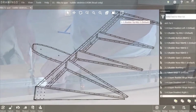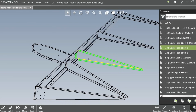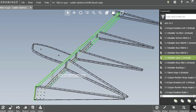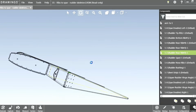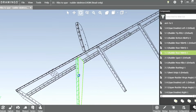Now, just a couple of questions. You say skeleton, so that's the internal section of the airplane, is that correct? Exactly, yes. It's spar and ribs, and then the skins cover the skeleton. And then you mentioned corrosion protection. What alloy are we working with here? We're working with 6061 T6, which has a lot of silicon in it, which is very corrosion resistant.